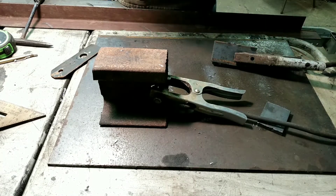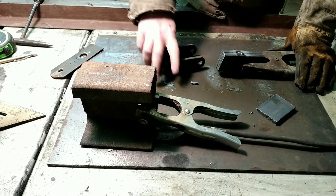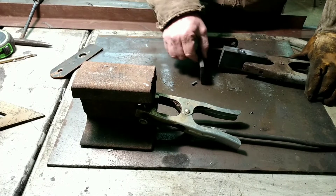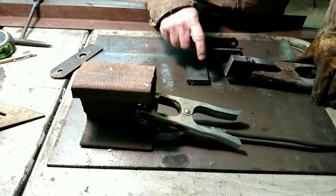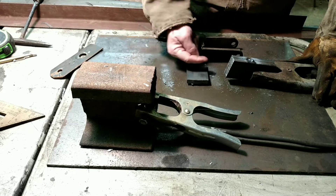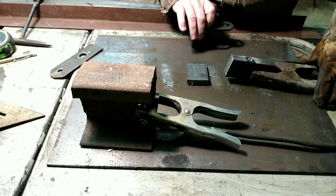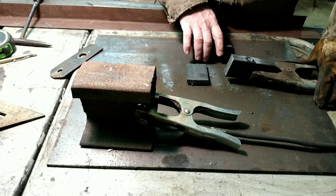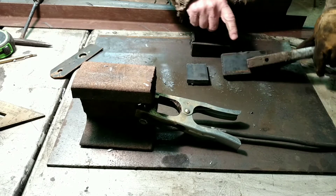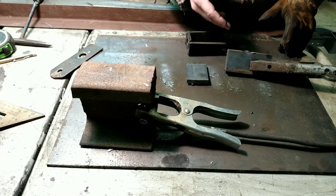So we're ready to drill these — we're building another one of these brackets. We've got to drill a three-quarter inch hole right there for the threaded rod to go through, and then we've got to drill what I think is half an inch down through there. The reason I weld these together first is that when I drill it, I know these two holes will be in alignment.